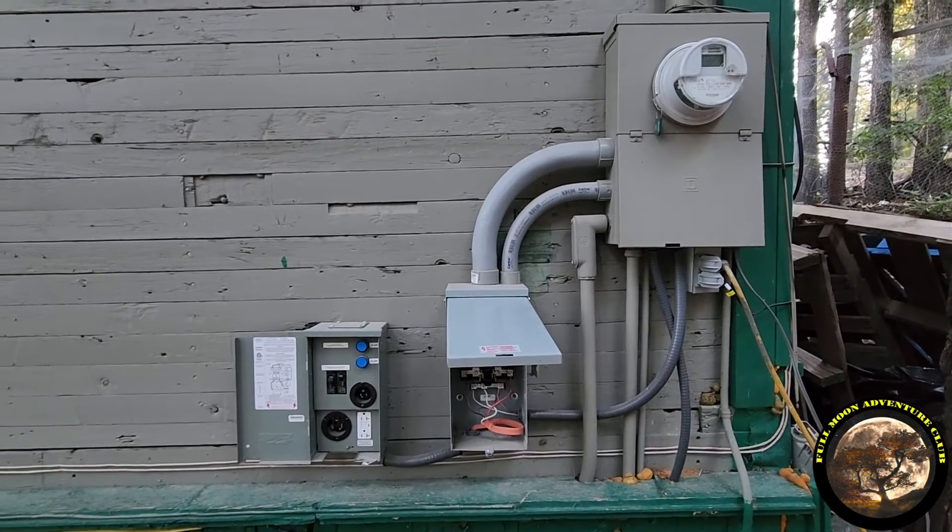I hope the way I explained it makes a little bit of sense. You're going to have to call the electric company — it's about $50 to pull the meter and $50 to reinstall it. You have to take it off so your panel is disconnected and an electrician can install all the necessary components. One of the most important is a transfer switch — you have to be able to disconnect your house from the grid before you hook up a generator. Otherwise you're going to send power from the generator up into the grid lines, the transformer will wind it up to huge voltages, and it'll send it back down the line and hurt a lineman. That's illegal and dangerous.